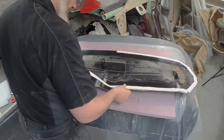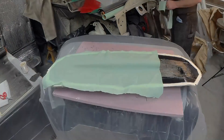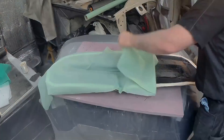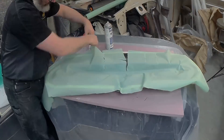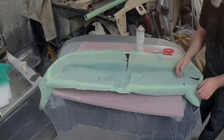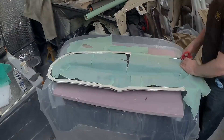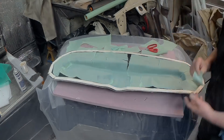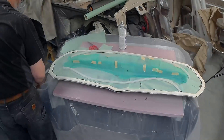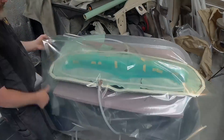I lost all the video on loading the mould, so nothing special with that. Because I've got a nice wide flange on this one, I was able to put the tacky tape on second. There are the three layers — you can see the two extra layers in the middle where the catch goes. I also had to fillet some of the corners because the fabric was bridging around the corner, so I stuffed some spare bits of fabric into the corners just to make sure it would contact the mould surface. All those go in and a little bit of the flow mesh goes on.